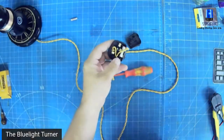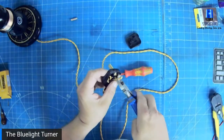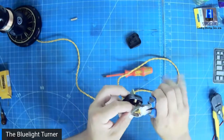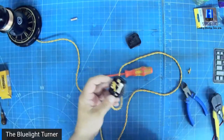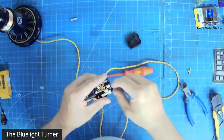I've wired a plug exactly once, you know, science class. It took me like 5 minutes. I know. It's brown bottom right, blue bottom left, earth straight up. Yep. And most plugs you buy now will come with a little card that tells you where to put them.